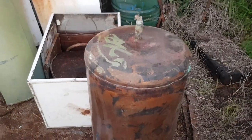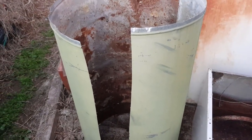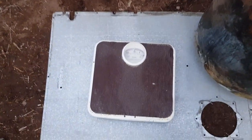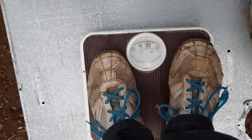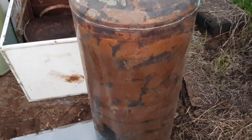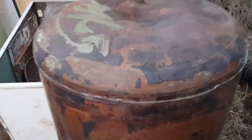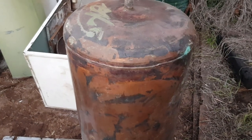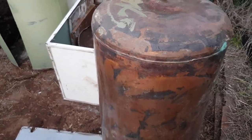I've got the cylinder out. The shell of the hot water cylinder is just light gauge tin — I may flatten that out and use it underneath pallets to keep weeds down, otherwise it can go in the pressing steel. Now I've got some bathroom scales: I weigh myself at about 74 kilos, and picking up the cylinder it reads about 82 kilos — so that's about 8 kilograms of copper. In Australia this would go as domestic copper because it has solder around the seams and some brass outlets and inlets.